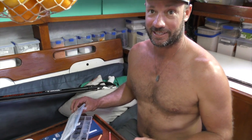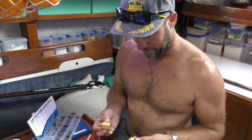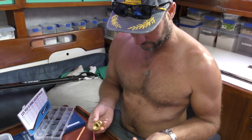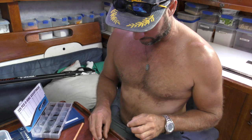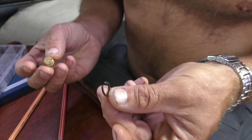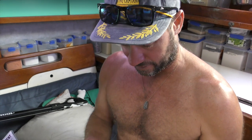Lee's boat tip for today: have a good assortment of O-rings. Today I've just come across a pressure relief valve on the dive unit that wasn't working, that was failing. I just pulled it apart, very simple little unit, but here we have it, perished O-rings. Probably 2 days ago we had another drip under the sink, again perished O-rings, and they're not that old. It's just a good handy little kit to have because so much stuff has O-rings in it and it gets you out of trouble.